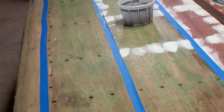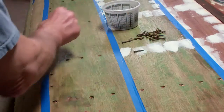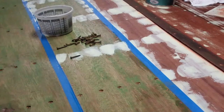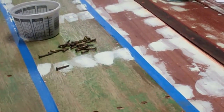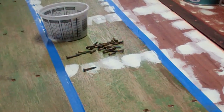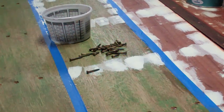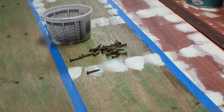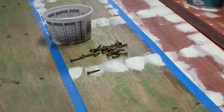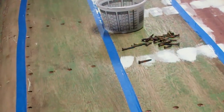In the end, we just couldn't save any of the fasteners. They were broken, decayed, they'd all been wet. They're probably the original brass fasteners — that's 1942, so 75 years those have been in place. They just weren't grabbing anymore. So we toothpicked all of the holes after releasing all of the fasteners.